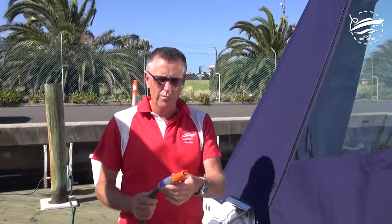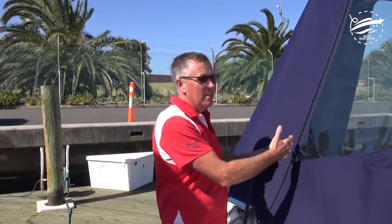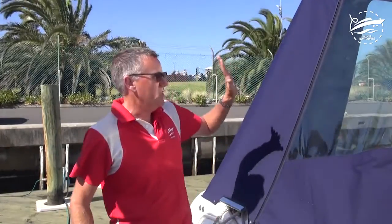A couple of little issues when you're motoring along in a seaway — most boaties will understand. I'm going to use a hose with a pressure top on it to simulate this. In a seaway when you're motoring home and your zips are closed, the boat punches through waves with spray or breeze coming quarter onto the boat. The acceleration of that spray hits the zip and with a non-waterproof zip it splinters through. At a helm situation, you're talking about somebody trying to navigate the boat with water coming through the zips — unacceptable. A customer should demand a waterproof zip. It just makes common sense.